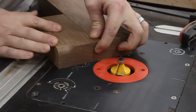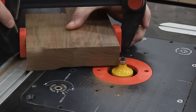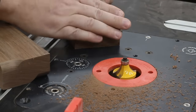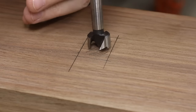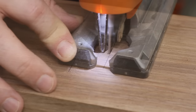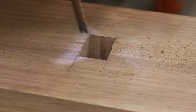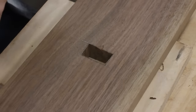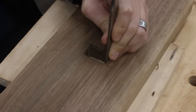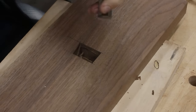Next, I gave the bottoms a big round over at the router table. I clamped on a piece of scrap against it so the edge was completely supported, which protected against any tear out from the router bit. The next step was to make the mortises that go in both of the sides. I started by using a Forstner bit and drilling a hole all the way through, then using a jigsaw to remove as much of the waste as I could. Once I had cut away the majority, I switched back to my chisels and used a knife line again to finish cleaning up the sides. I went about halfway down, flipped the piece over, and continued from the other side so as not to have any nasty tear out.